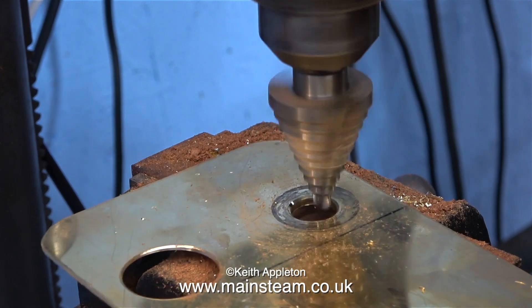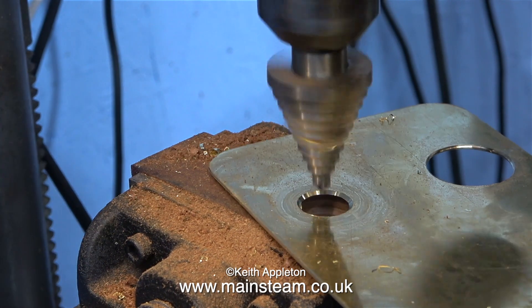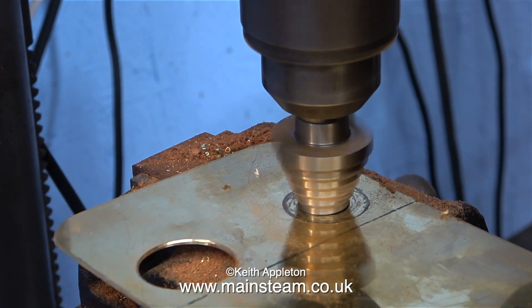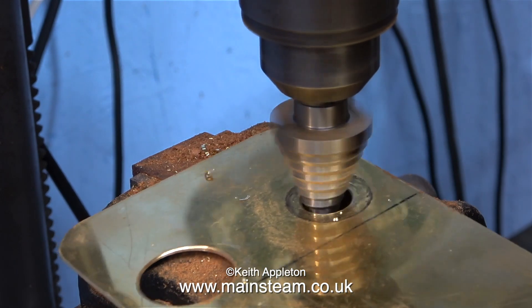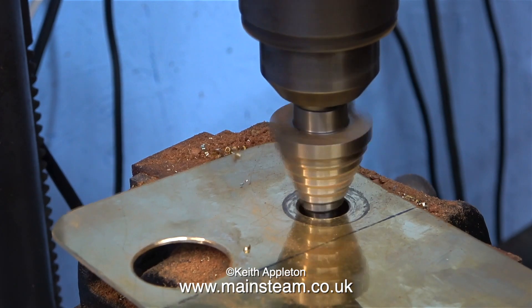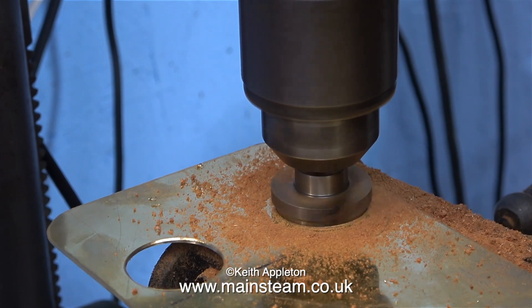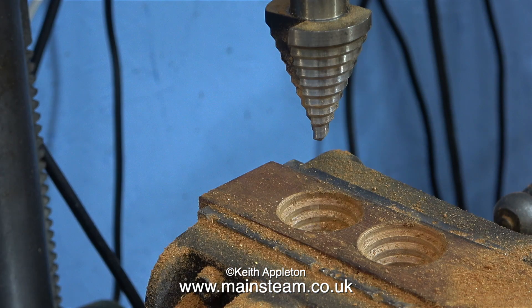Once it's on track you can hear the different sound it's making. It's a good idea with these type of cutters to periodically turn them over and drill from the other side — that way you get rid of the countersink effect and the cutter cuts much more freely. I'm putting quite a lot of side pressure on here to move the position of the hole because it's not exactly in the center. Back to the story: there I sat drilling holes as a very bored 16-year-old with very long hair, which suddenly got entangled in the chuck. It pulled my head very quickly towards the chuck and I headbutted it. Thankfully it was the smaller machine and the belt slipped, so I turned it off very quickly. If I'd been on the more powerful drilling machine it would have been a different story — I would have ended up with a bald patch or possibly a hole in my head.